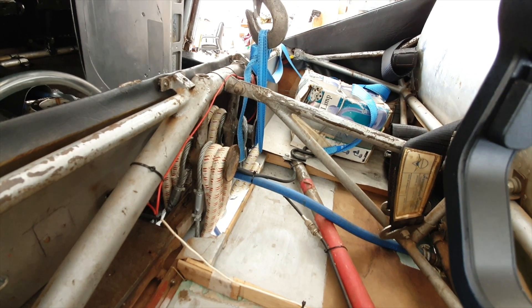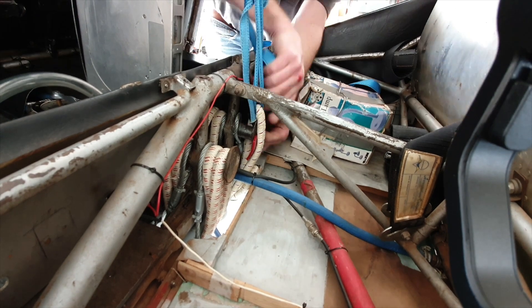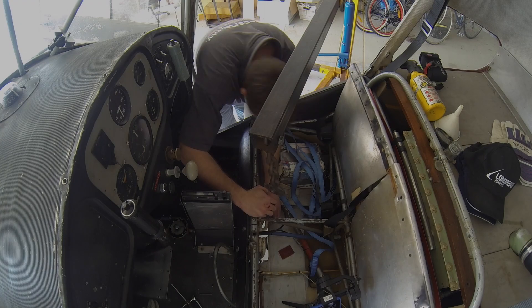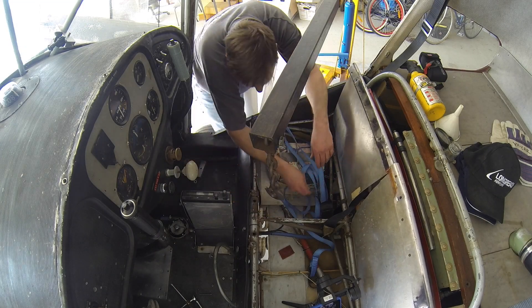The last time I used the engine hoist to install new bungees, I had a friend helping. This time I'm solo, and so part way through lifting the bungee into place I decide I need something to help ease the bungee over the edge of the bobbin so the cotton braid isn't damaged.